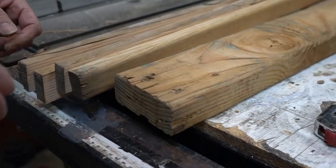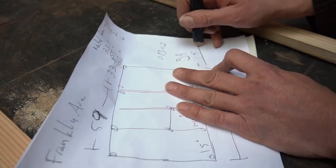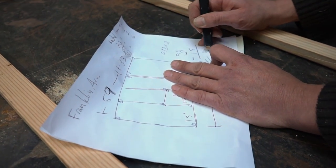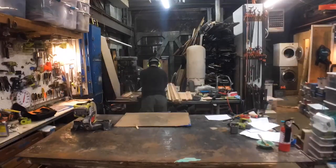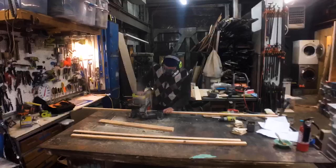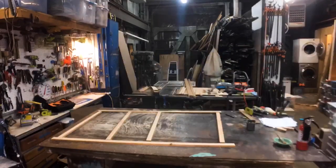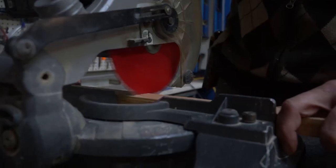After you have gathered your materials, familiarize yourself with the design. If you haven't already made a shop drawing, you should. You need a reference of the layout with dimensions. The construction method is intentionally rough. It allows for minor measurement errors and imperfections in the wood. Because of that, we cannot cut any door parts yet. You might be planning for a 13-inch door, but end up with 12.5 inches of space. So hold off on prepping for any door or opening parts.